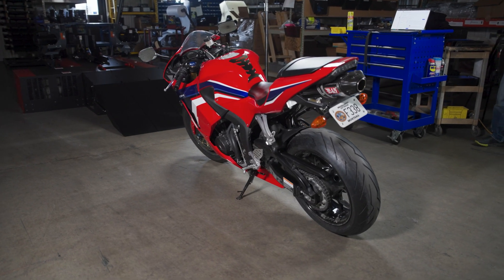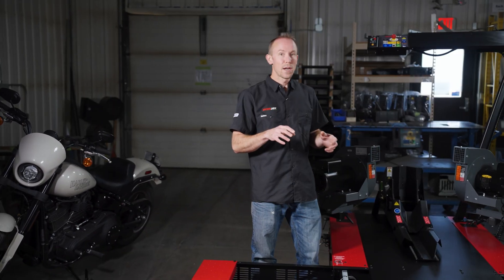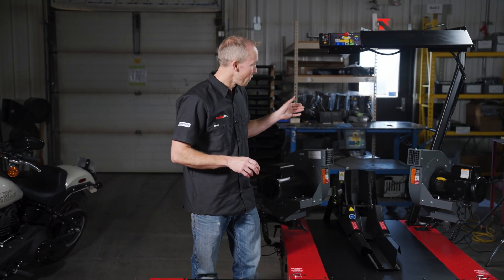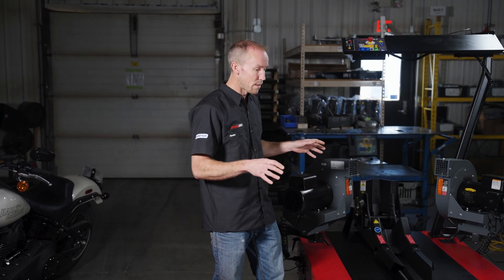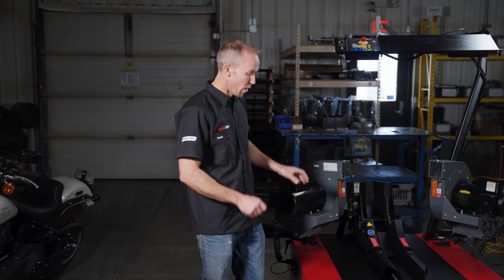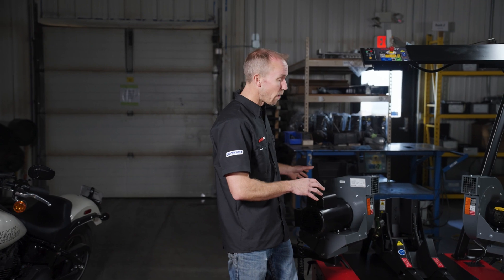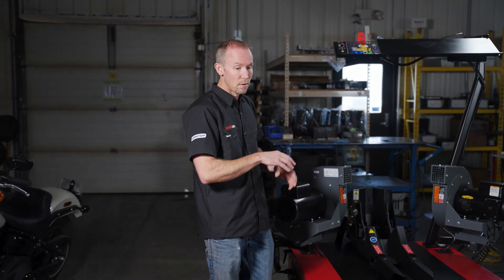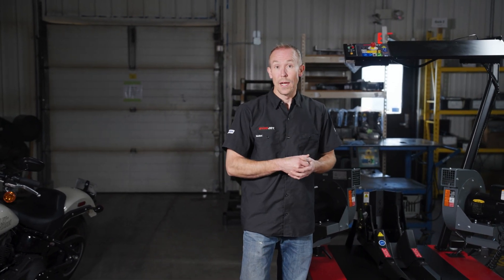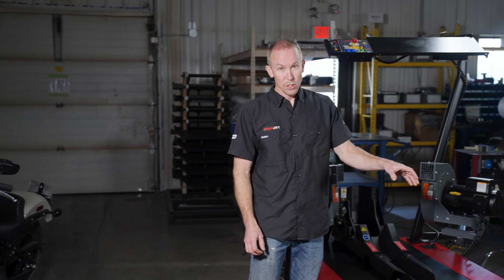For the basics on how this dyno is run: we recommend a 240-volt single-phase circuit with up to 30 amps of service. You can run our dynos on 110V, but the CPI module and any accessory fans and starters will not be operational. On 110V you would only be powering your DynoWare RT box on a 200i dyno.